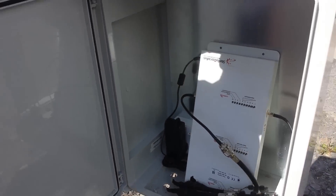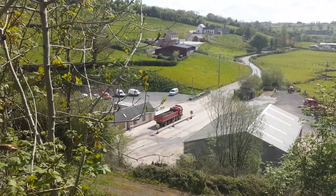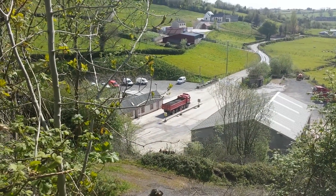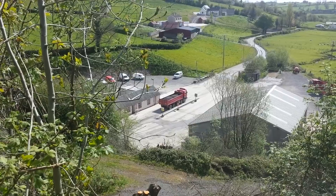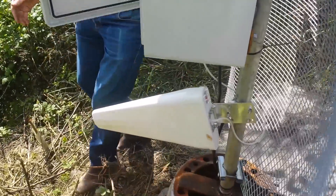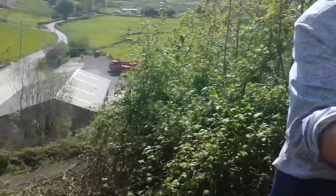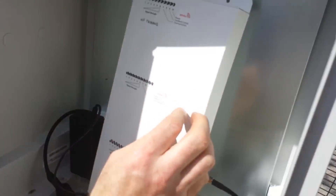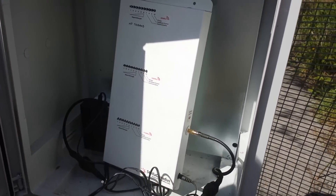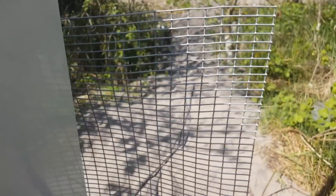This is the second location. We amplify and send the signal down to this office area — there's a workplace for trucks and an office area with no mobile phone signal either. This antenna beams a signal down to that whole area. Inside here is the power amplifier, which amplifies the signal that's already been amplified by the repeater, gives it an extra boost, and sends it down into this area behind me.